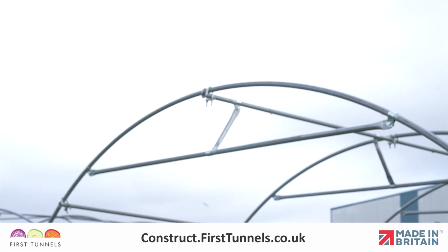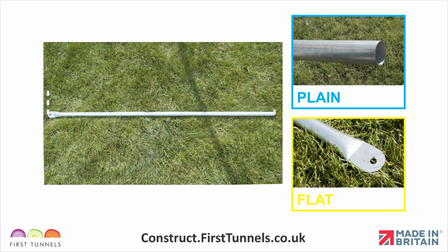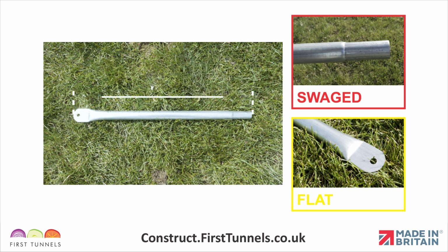The door rail spans across the width of your polytunnel on the end hoops. Door rails are supplied in two pieces. One is 1.57 meters long and is flattened at one end and plain on the opposite end. The second piece is 50 centimeters long and is flat at one end and swaged at the opposite.